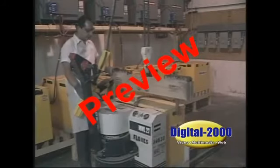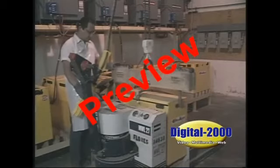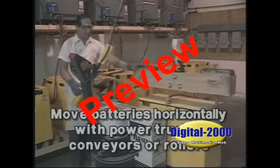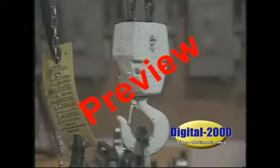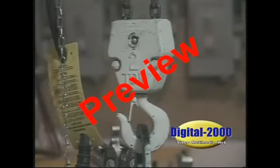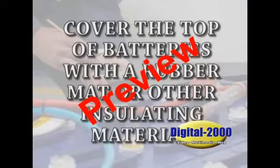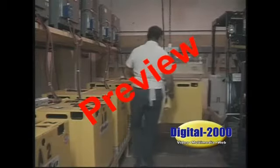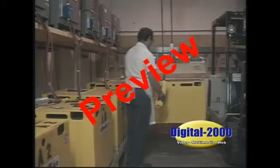Always lift batteries with mechanical equipment such as a hoist, crane, or lift truck. Move batteries horizontally with power trucks, conveyors, or rollers. Make sure that hoist hooks, spreader bars, and other tools are of ample strength and properly installed. Cover top of batteries with a rubber mat or other insulating material to prevent external short circuits from chains or cables falling onto the top of the battery. Proper handling of batteries is essential to prevent injuries and to prevent battery damage or electrolyte spills.